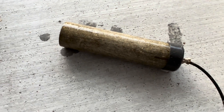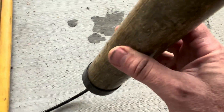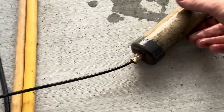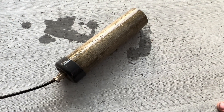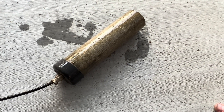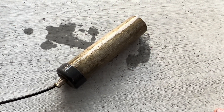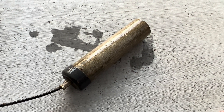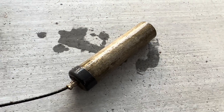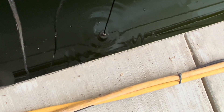This is magnesium — a two-pound chunk of magnesium with a stainless steel bolt that goes through the metal all the way to the outside. What this does is, if another boat has failed to take care of their zincs, that electricity is going to flow from their boat over to your boat and start tearing up your zincs. If you don't pull your boat and check your zincs, yours are going to be eaten up prematurely. This is just an add-on for extra protection.